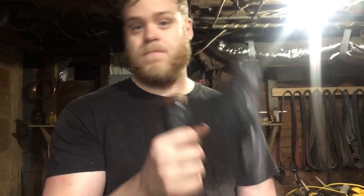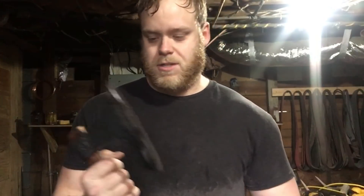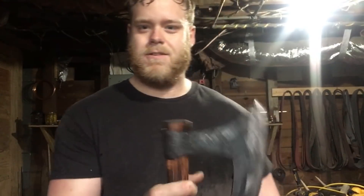So here she is all done. Very happy with the way this one came out. It was a long road starting with that big chunk of leaf spring — it was kind of a dumb idea. Next time I do it I'll probably just start with quarter-inch 5160 flat bar. But I set out to make one from scrap and that's what I did. So if you watched the whole video, learn from my mistakes — but we did get a beautiful and serviceable axe out of it. How cool is that? Please like, share, subscribe, all that jazz. Lots more cool stuff coming like always — thank you.